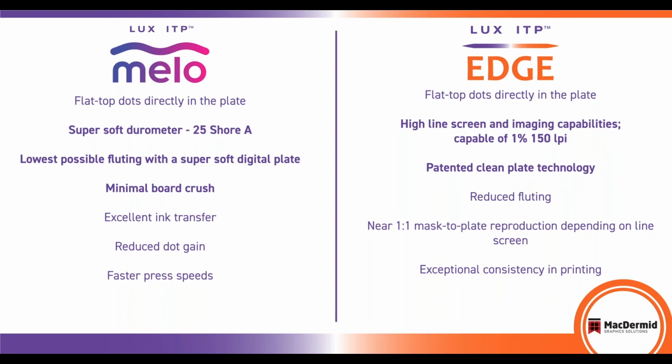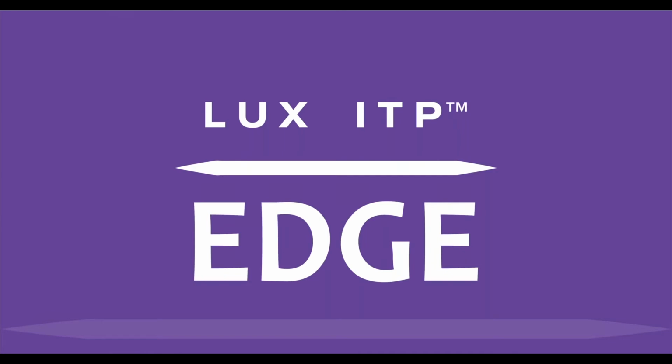This particular plate is recommended for all corrugated applications, but is especially designed for the low basis weight recycled board applications. Comparing it to the new EDGE plate, EDGE again is flat top directly in the plate. It is designed for incredibly high line screen and imaging capabilities, 1% at 150 lines. It includes our patented clean plate technology. The imaging and the flat top dots allow for reduced fluting. Again, a near one-to-one mask reproduction, depending upon line screens. Exceptional consistency in print, and is recommended for all applications in post-print corrugated. LUX ITP EDGE.